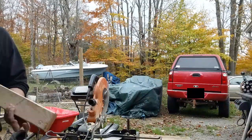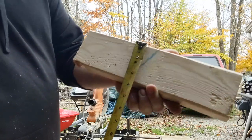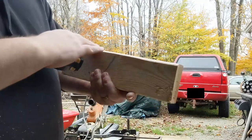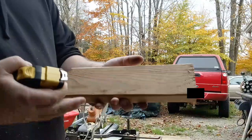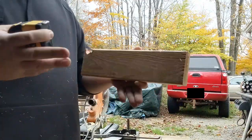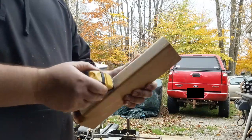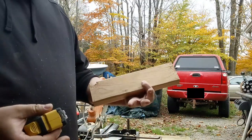If I were to come up here and show you guys, this is a standard 2x4 — it only measures 3.5 inches by 1.5 inches. So when they plane that material down to get it nice and smooth for us, they do lose some material. They still classify it as a 2x4, but the measurements are actually 3.5 by 1.5. So make sure you keep that into account when you're measuring and building your aquarium stands.